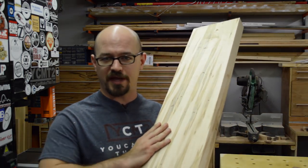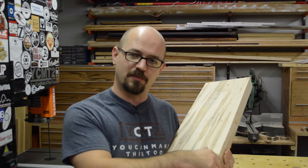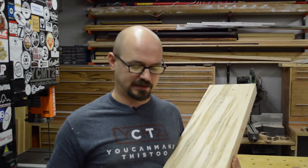I'm Caleb Harris and today I'm making some clipboards. So far I took this piece of ambrosia maple to my jointer and jointed one edge, then ripped it on the table saw. So now I know both edges are 90 degrees to the face and this board is the same width all the way down its length.